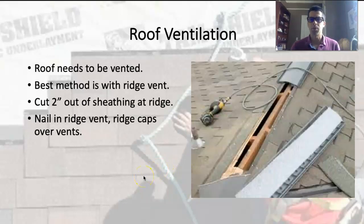We need to provide some sort of ventilation method for a roof, and the most common and effective one is a ridge vent. Generally, you roof it as normal, do all your roofing, but before you put the ridge cap on, you come back and cut plywood out of the way — cut an inch out of the sheathing on each side of the roof. When you have this ridge vent in conjunction with a soffit vent, the attic is going to draw in outside air and push the hot, moist air that accumulates inside out through the ridge vent, removing that moist air.